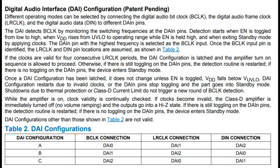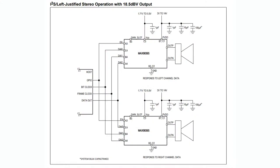There's a full description and a couple of example wiring diagrams. You can see how to wire it up for left channel versus right channel — DA1 and DA2 are swapped between the two, and that's how it knows whether it's left or right. Compare this to the MAX98357, where you have to short a dedicated pin to select left or right; here you just change the pin wiring order.